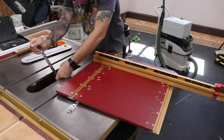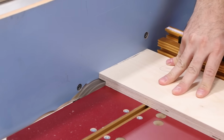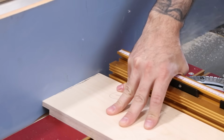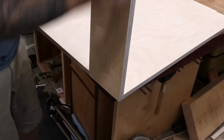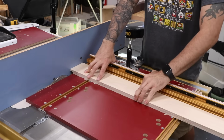I'll install my dado blade and bury it partially inside a sacrificial fence. The amount of dado protruding from the fence should be the same as the thickness of the plywood. The height should be set so that it leaves a 1/2 inch of material on the cleat. When the cut is perfect, the cleat will set into the notch so that it's perfectly flush. All of the cleats will receive the rabbet on the end.